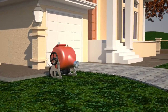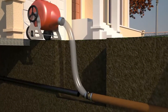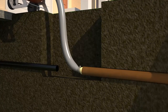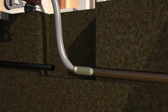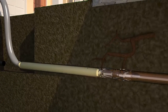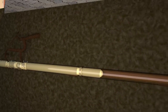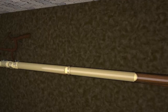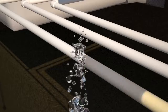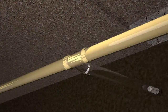The solution is pipelining. For sewer lines, only a single access pit is needed. A flexible liner, saturated with epoxy, is inflated into the broken sewer line either downstream to the sewer main at the street or upstream to the house. The same process can be used to renew swimming pool supply or drain pipes, as well as piping under slab floors.